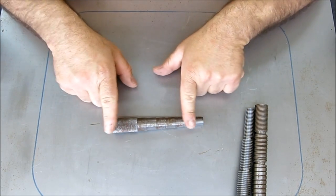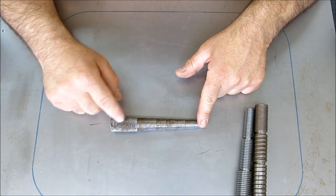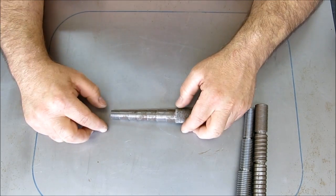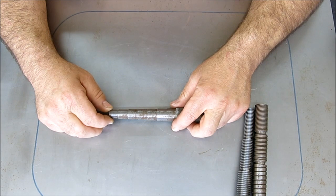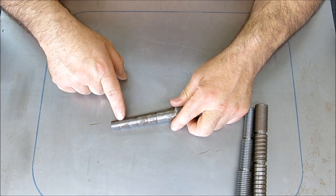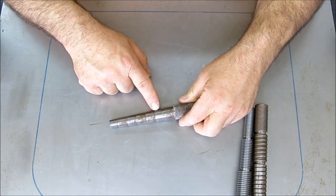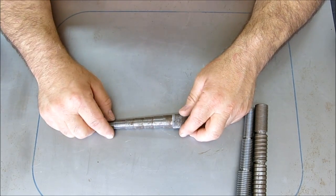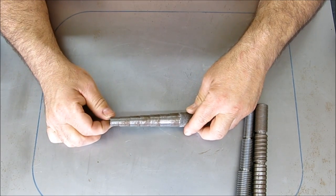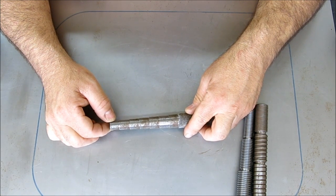for that class. So this is the classic step mandrel here, where you're given a piece of material and you have to turn some diameters here, and actually they're labeled here. Let's see if I can read them. It's a little rusty here. This one says 5502.6007, 6 something, 750, 800, I don't know. So I don't know what the targets were, if the targets were some kind of even steps, or if they were strange diameters that they were just trying to hit those numbers.